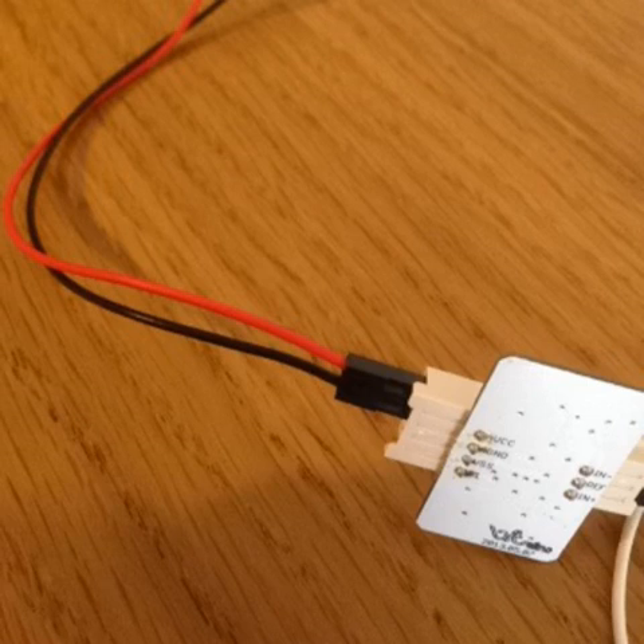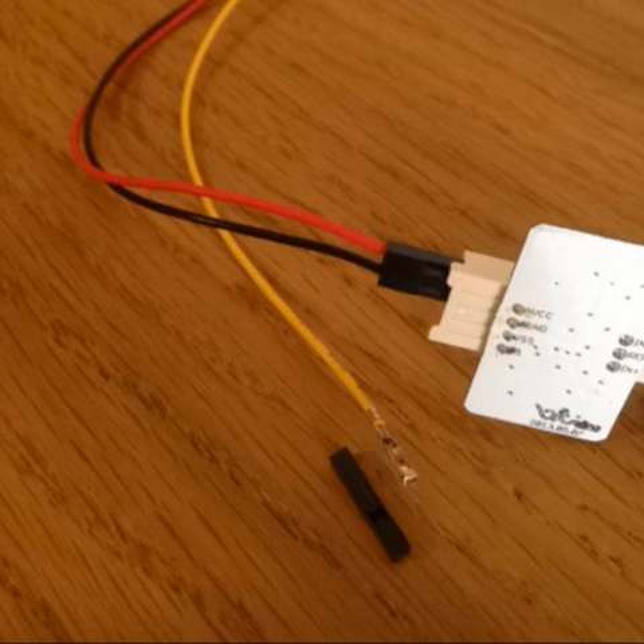Let's start by tapping into the sensor pins. Connect the red wire to the VCC and the black to the ground — these will be our power lines. You'll see that the plastic housing is too wide for all the wires to be placed side by side, so take off the housing on one of them and save it — it will come in handy later.